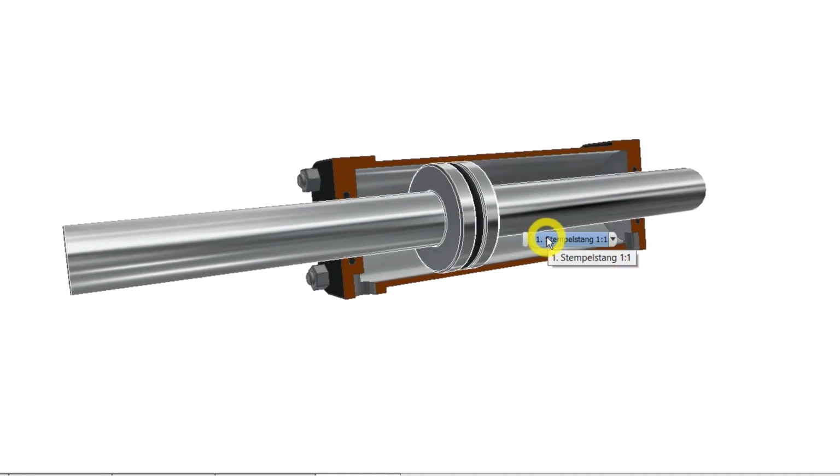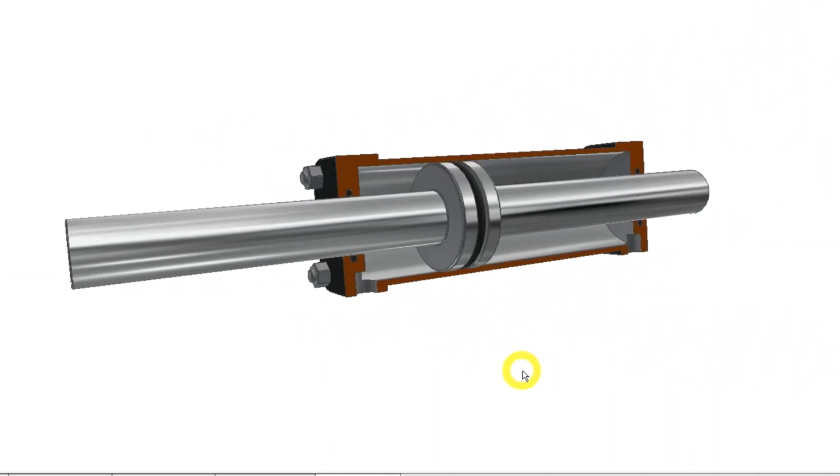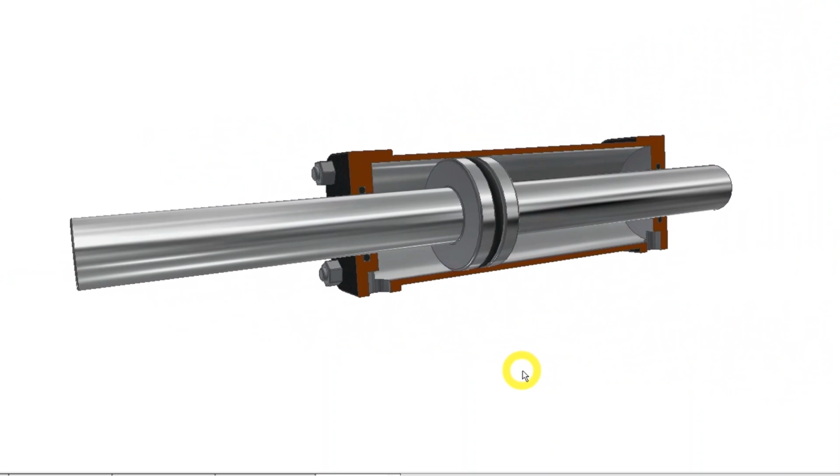You can see it on hydraulic steering systems on boats. If it was designed with 1 piston rod, you would need to turn the wheel more in one direction than in the other in order to obtain the same angular difference on the motor. With this design, 1 turn of the wheel gives the same steering effect on the motor, regardless of the direction in which the wheel is turned.